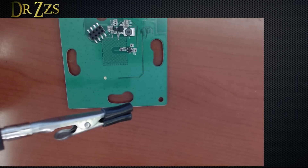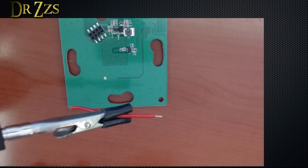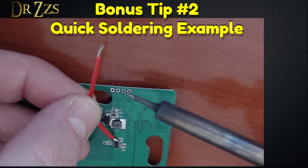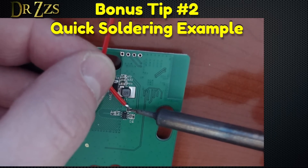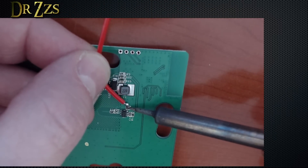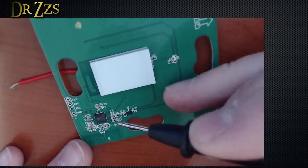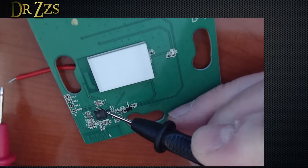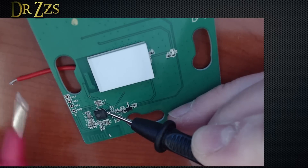Connecting to GPIO0 is going to be a little tricky — we'll have to solder on a wire. I'm going to take this tiny little bit of spare wire, put a little bit of solder on the tip. I want this wire to be able to reach the ground pin. I'll take that soldered tip and heat it up next to that resistor. Now I'll flip this back over, put my probe on GPIO0 — counting in one, two pins right there — and touch this wire. So now I've extended GPIO0 to someplace where I can reach it.